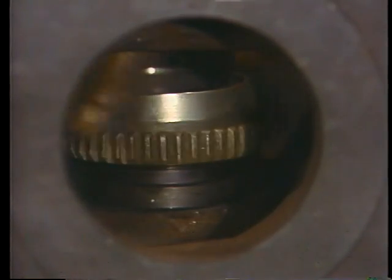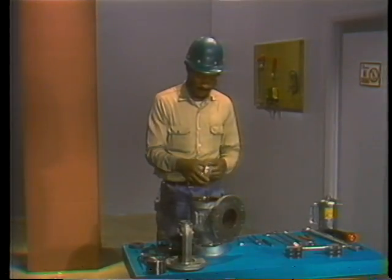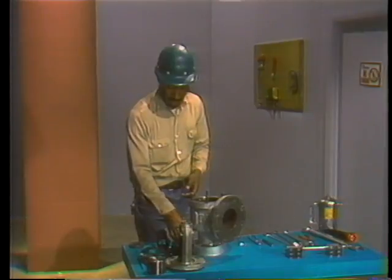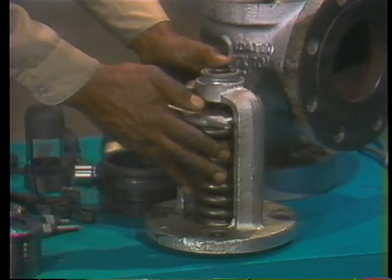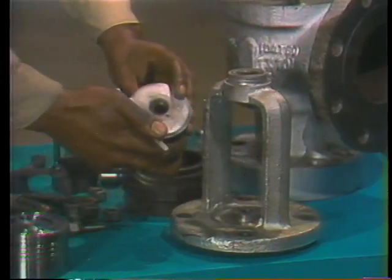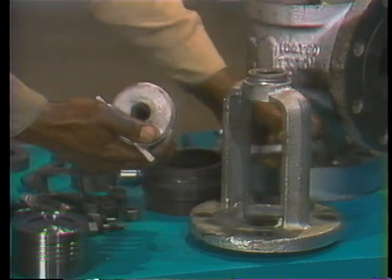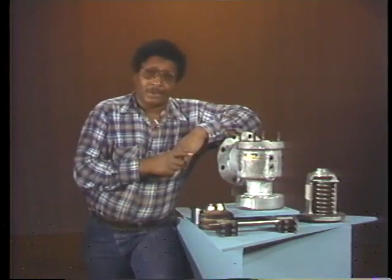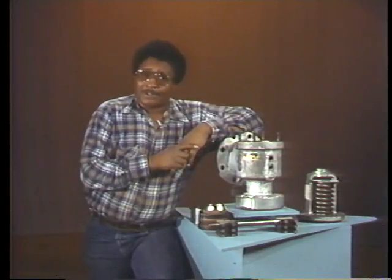This gives him the information he needs for reinstalling the lower ring in its original position later on. He then removes the lapping block and turns the lower ring until it disengages from the threads in the valve body. He removes the ring, briefly inspects it for obvious signs of wear or damage, and sets it aside. All that remains now is to remove the spring and the spring washers from the yoke. This is done very simply by tilting the top of the spring outward. A quick inspection will tell you whether or not these parts are in good condition.